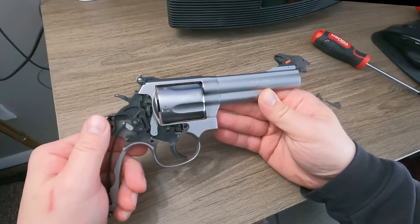With the hammer block in place, the rebound slide completely controls it. When the gun is cocked and ready to fire, the hammer block stays out of the way. Let off the trigger and let the hammer drop — it lifts up to that position, making it a secondary impossibility for the hammer to reach the firing pin. This is never impacted pretty much ever, unless you're letting down the hammer. Even then, most of that impact is stopped right there on those little nubs on the rebound slide.